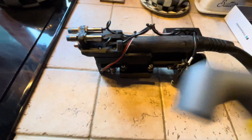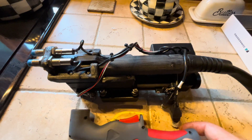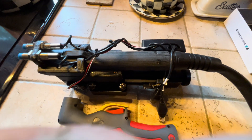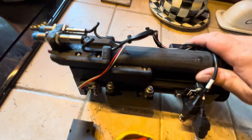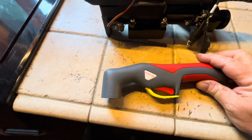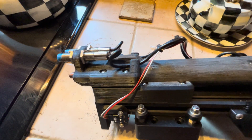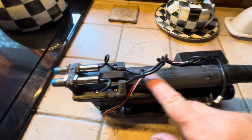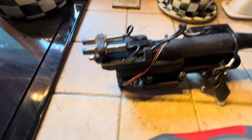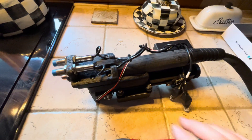It came with this handle set, but as you can see, there's nothing in it. That's because I went ahead and spent some time in CAD last night and 3D printed a new torch hood holder. By just taking the tubing that went out on the 90 degree end and spinning it around, I made it virtually straight, and with a little extra design work, I made a chamber inside this round tube that's bolted together, and it actually holds the whole plasma torch.